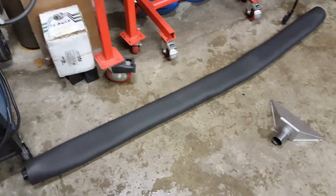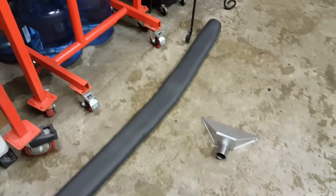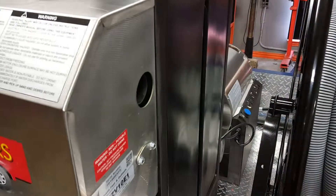This is a scooper. The black thing on the ground is a water berm. You fill that up with water — there's four of them — so you make a pretty good size semi-circle to capture where your runoff is going. It gets sucked up through the scooper, through the vacuum hose, into the inlet, and then it goes into here.